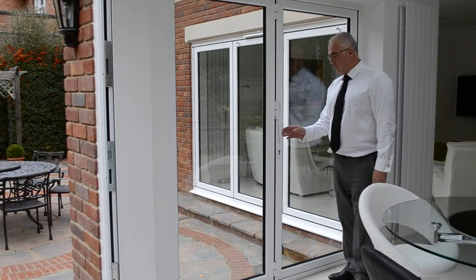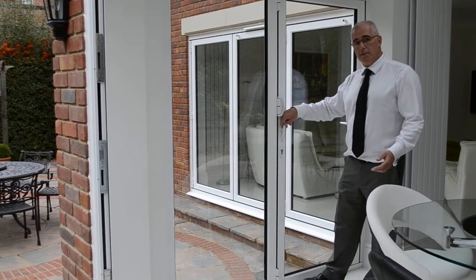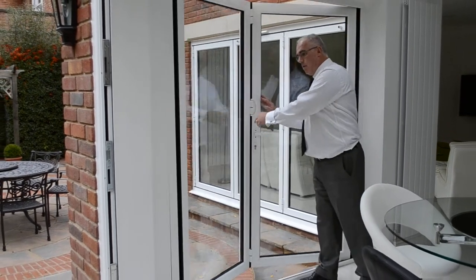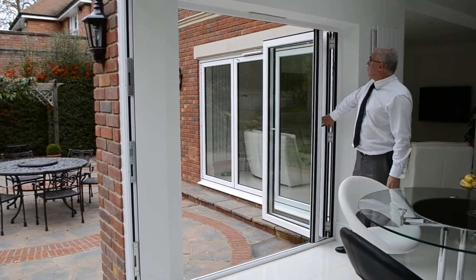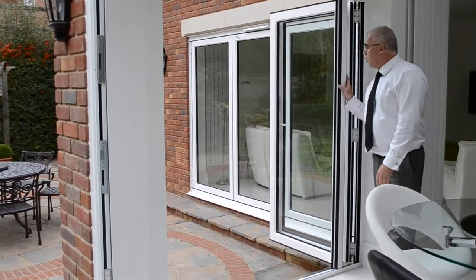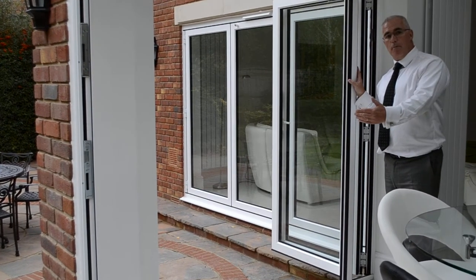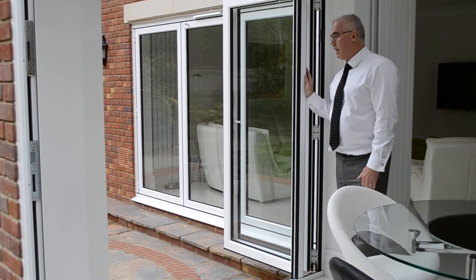This is a nice little two-fold set of doors. We have two panels that represent a French door, but it's an alternative to your standard French door in that both doors come open in one direction. What you will notice is this separate piece of aluminum, which is a floating mullion. On all doors where you have an equal number of panels coming in one direction, you'll have to have a floating mullion.